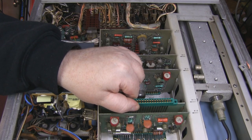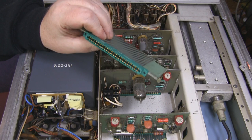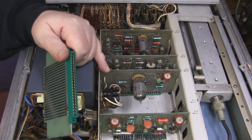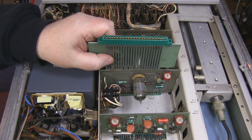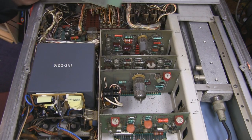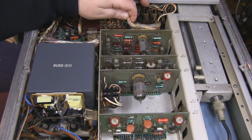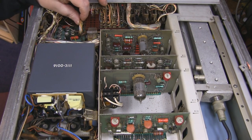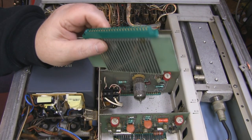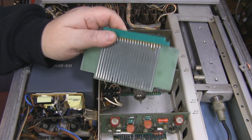This is something you see a lot from around this time with the HP stuff - it's an expansion card so you can put a test jig in here. You can probably take these cards out, plug your test equipment in, and actually expand out to test for failure along all these wiring looms and components, because trying to track a fault down in these wires would have been a major headache. These kinds of expansion cards you do see a lot in the vintage HP stuff from 1960, 1970, and 1980.